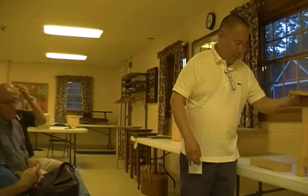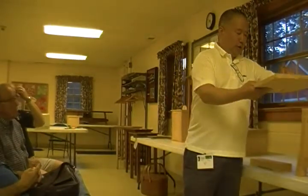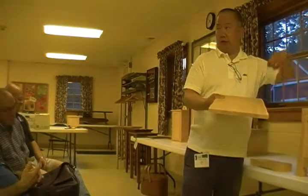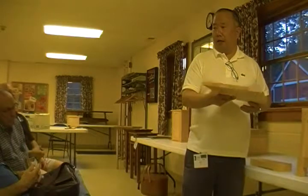How's the top going to be attached? Oh, yeah. Basically, the way that it's usually done is drill a hole in the top that goes into probably where the legs are, because that's the biggest target, and just pegs to hold it in. But you'll split the top that way. No, I won't. It's quarter sawn to start with, so it's not going to move. And that's how Fallonby did it. It'll be fine. Like I said, it's been sitting around long enough that it's actually stable.